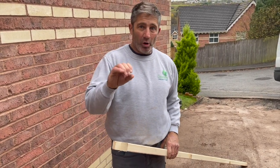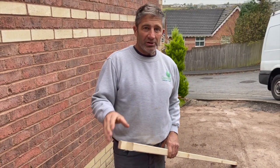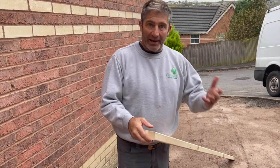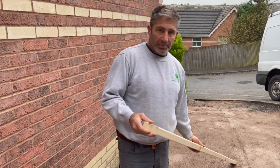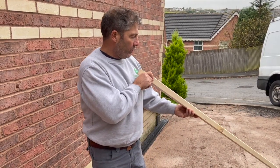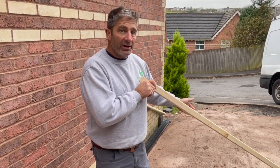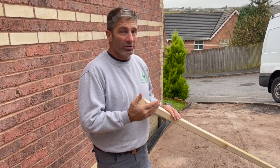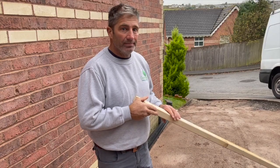Tools out, like Probst tools, do a selection of screed bars, screed rails, and they're good and they work. But sometimes you need to improvise, and like I said, this is a perfectly adequate straight edge for this installation. It'd be beneficial, if you are using wood in the future, to change it for each job.